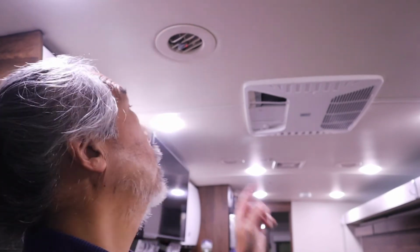There's a fair bit of air leaking around the temperature sensor when it was mounted directly on the air conditioner. So I've moved it over to a duct right over here, and now I've got the cold air blowing directly through the duct, and our sensor is now reading 33 degrees. So it looks like the air conditioner is functioning, and it's running on less than 20 amps. So I would have to say that our SoftStartRV installation was successful.